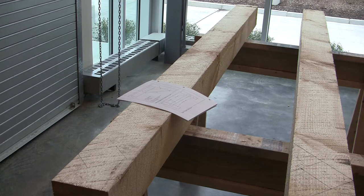Just like our other members, I'm going to use a combination of the circular saw and a hand saw to make these cuts. I'm going to shape and form the tenons with a chisel, use a circular saw to make the cheek cuts, then go ahead and shape the tenons. I'm going to start making some cuts and then we'll come back so you can see part way through.